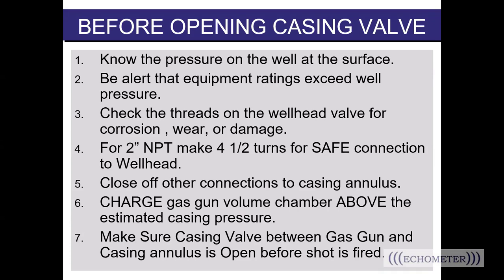Do not use any type of quick connect between the gun and the wellhead, as those connectors will not have the same pressure rating as your gun. If you're using any type of fitting between the gun and the wellhead, know the pressure rating on that fitting — that has to be your maximum allowable pressure. If that pressure rating is less than the working pressure engraved on your equipment, be safe: if conditions aren't safe, maybe you shouldn't shoot a fluid level on that well.